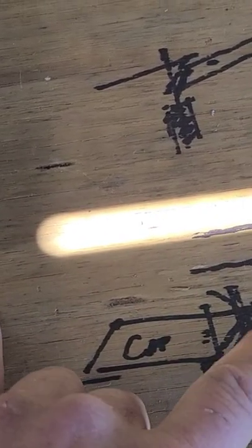If you're doing paint grade, there is more room for error or for slop, because you can caulk it and paint it afterwards and it's going to hide all your mistakes. But if you're doing stain grade, where that wood is going to be visible, you can use wood filler, but wood filler stands out like a sore thumb. If you don't know what you're doing, you know, there is an art to that as well. If you're a good painter, you can cover it up pretty well. But most of the time, wood putty is going to have a different texture, a different color than the trim you're actually using. So with stain grade, you don't have that wiggle room. It's got to be a perfect splice the first time and fastened correctly.